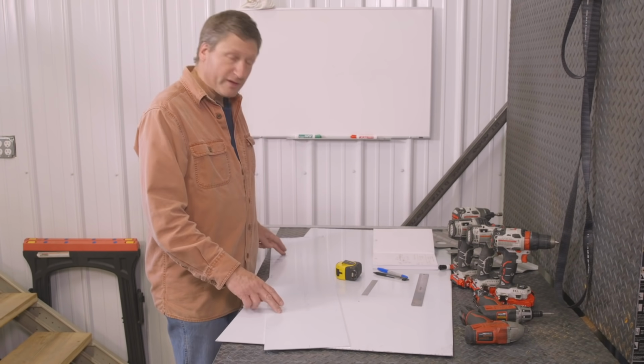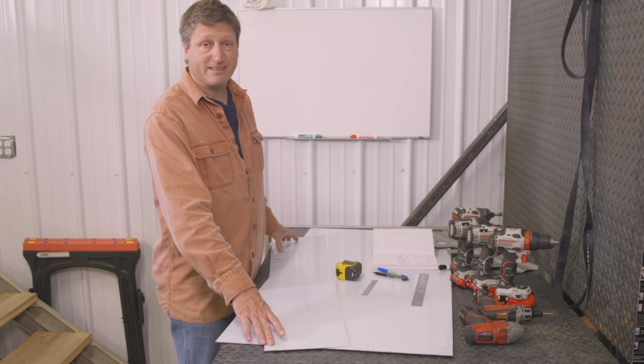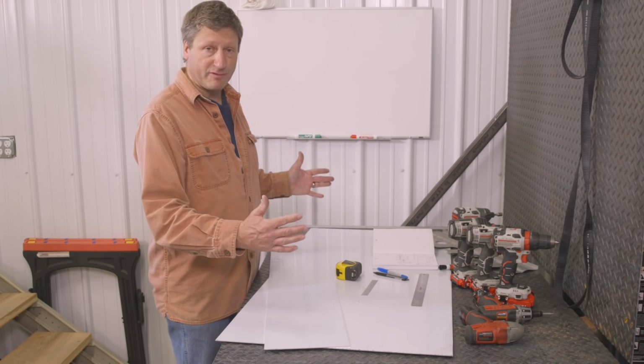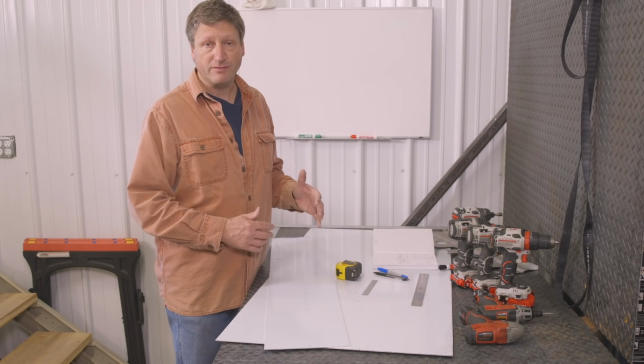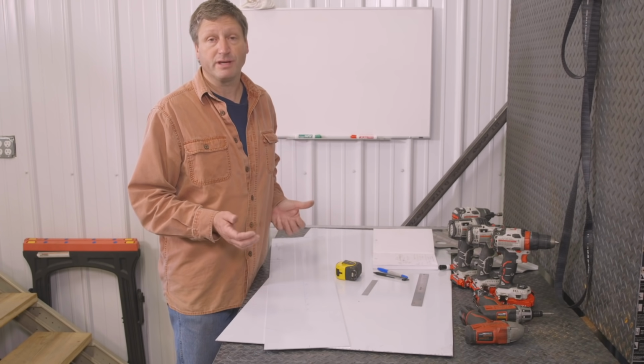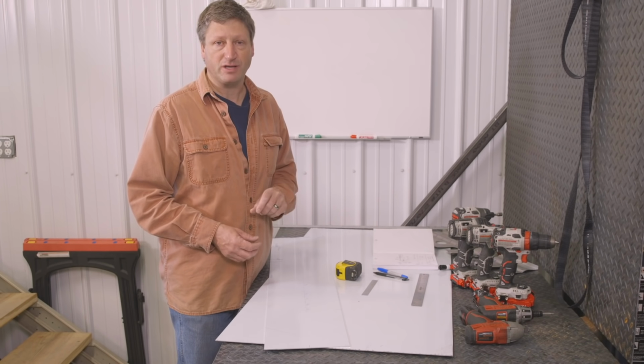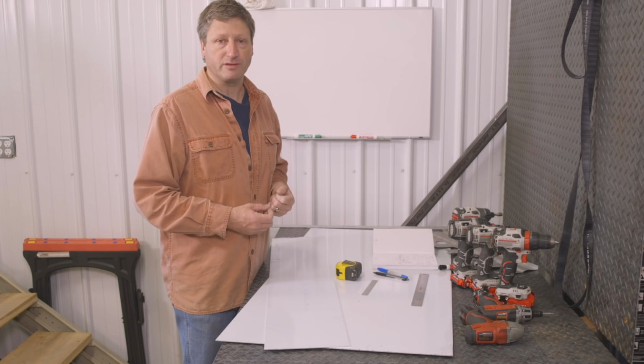So I measured that originally from 23 inches wide, and I added 10 inches on each side that's going to be bent up for the sides. My charger shelf is going to be a straight 9 inches wide by 23 inches long. But I'm going to bend a 1/2 inch lip on the end of that shelf, again, to hold the chargers in place.